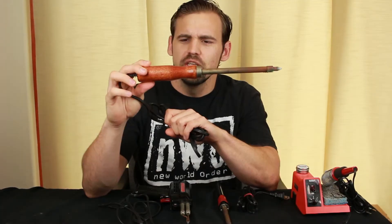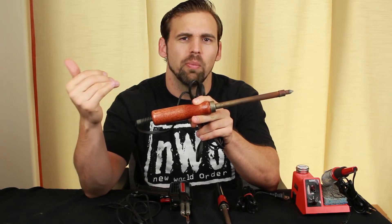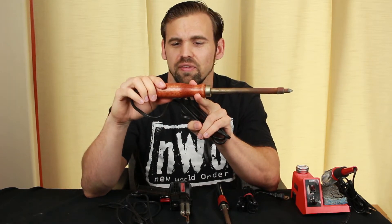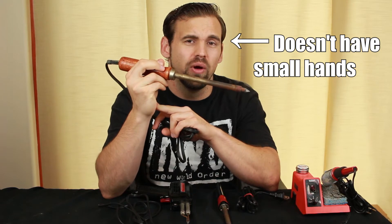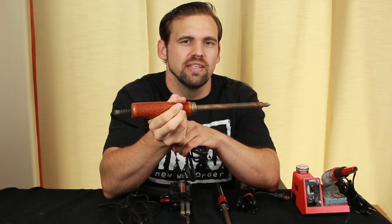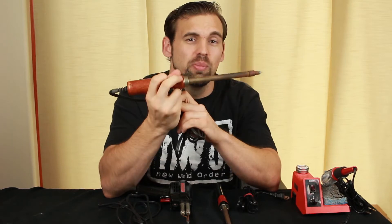The first one to my left is an old-looking one with a wooden handle. This is made by Dunlap — a company originally owned by Sears back in the 40s, operating from the 40s to the 60s, so this soldering iron is older than I am. It's a 5408, 115 volt, 80 watt. This thing is massive, so it's not really what we want to use for small PCBs. It's more useful for soldering wires. Components back in the 50s and 60s were really big, so this would have been useful back then — today, not very useful.